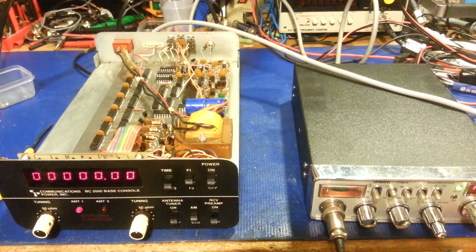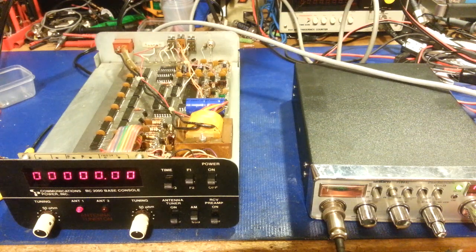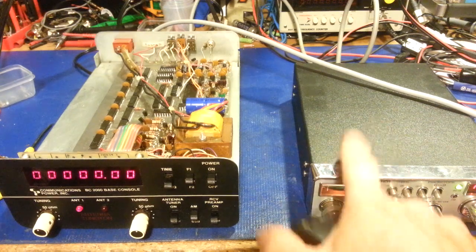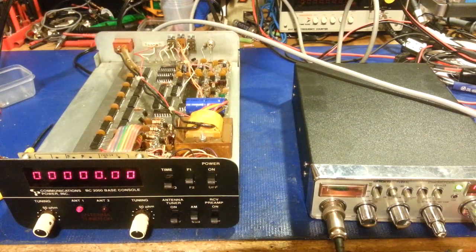And we can see we now have a display. And the frequency counter does work somewhat. It still has some problems, so I have to take it back apart again. But it does work. It's nowhere close to accurate now because of the problem, which I'll show you in a second. So it's hooked up to a radio, and the output of this runs over to the BK1040. So if I put the radio on channel 19, that should show up 27.185 over here.